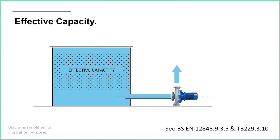because in this instance we've got a pipe coming in from the side. So obviously when that water drops below the top of that pipe level, then it's not going to be quite the same as it was before. And the pump needs that constant force of water coming through to basically prime it. Otherwise, it's dragging in air. These fire pumps don't like pumping air, so the pump will what's called cavitate. It basically means it'll implode or it'll break apart.